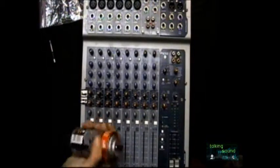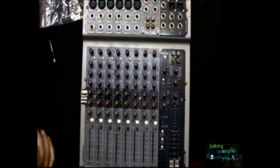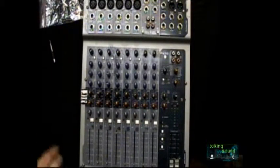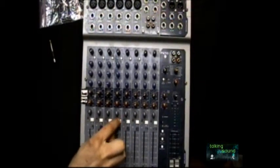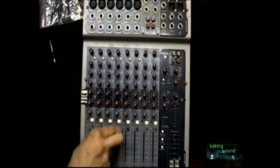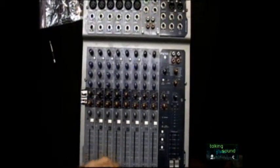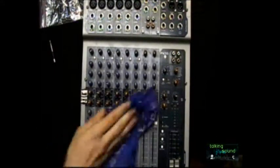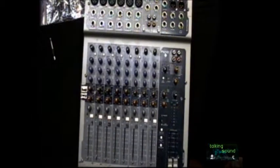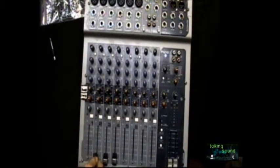Bring the fader up and take your cleanser all the way down the fader track — make sure to get it right inside. You could actually see the inside of the fader track in most faders if you lit it well enough. Once that's done, pop the mute switch a good 20 to 25 times, then pop the fader up and down a good 20 to 25 times as well. Then wipe it all down — and at that point we have one officially cleaned channel on the soundboard.